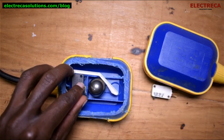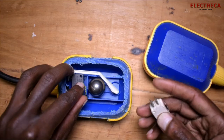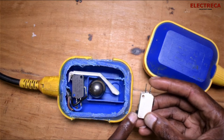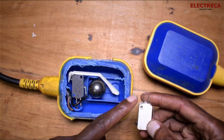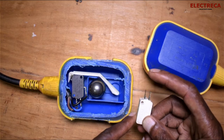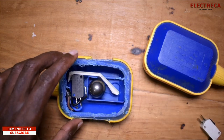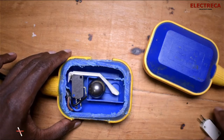So when the ball comes back, the lever comes back also and the circuit will be open. It's the same thing in reverse. Right now, holding this piece of switch, the knob is out. If you test between the common and one of the contacts, you'll find one is open and the other is closed. When I press, this one becomes closed and that one becomes open. When I release, it swaps — that's how it works.